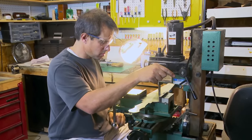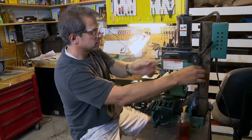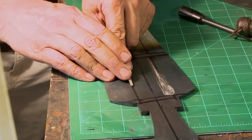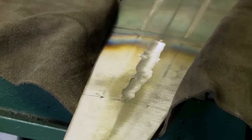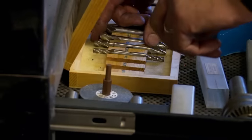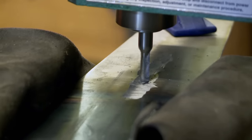I've got the blade in the mill, and the milling bit is just skating right over the surface — it's polishing, not cutting. Option B is to try freehanding it with a file, but the file is just dancing over the surface of the blade. Option C is to try to freehand it on the grinder, but that just looks terrible. This is like a perfect storm of anxiety — doing something for the first time that's very challenging, $10,000 on the line. So I use a smaller milling bit, and lo and behold, it just starts biting into that steel just the way I want it. It's cutting a slot.